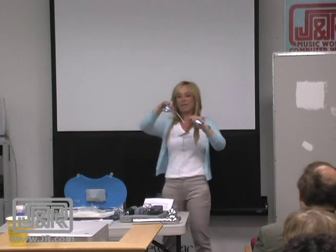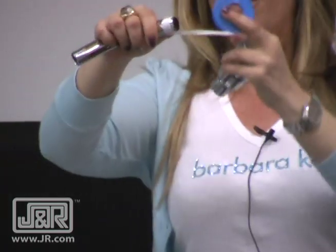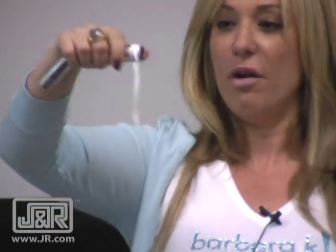It's really easy to change your shower head. All you need is a plier, okay, or a wrench. You go to the hardware store, and I picked this up yesterday for 99 cents. This is called sealant tape, and the sealant tape wraps around this stem, and this is what prevents the water from coming in.